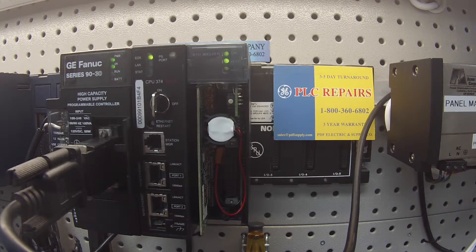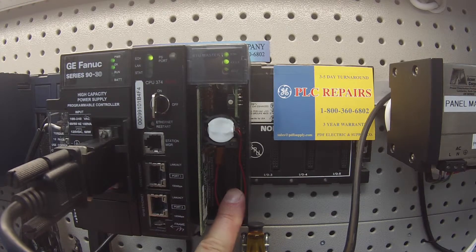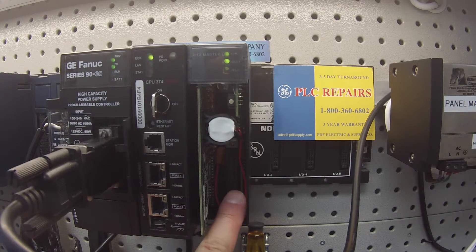There are two things that I do when I test. The first thing is that I'll convert the RTM over to a PCM — an IC693PCM301. What I'm going to do with that is test this port to make sure that the RS232 and the RS485 are in good working condition. That's on this side of the board.